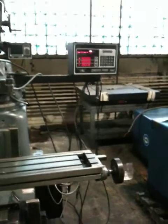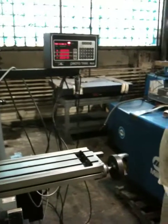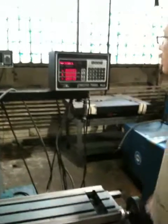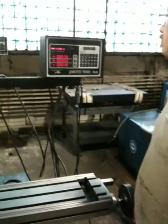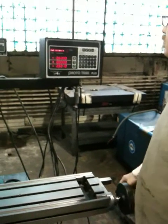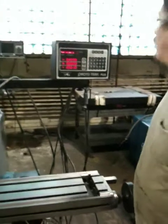Now the ball screw — move it by hand a little bit just to show that when he moves it by hand, you can see there's no backlash because, again, it's ball screw. Half a thousand, five-tenths resolution, zeros and fives.